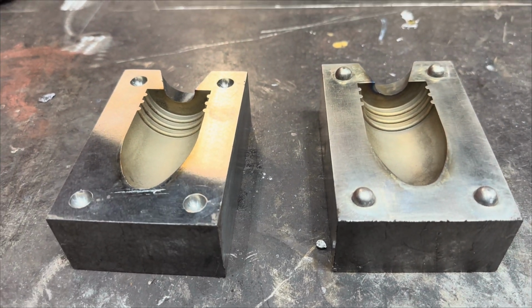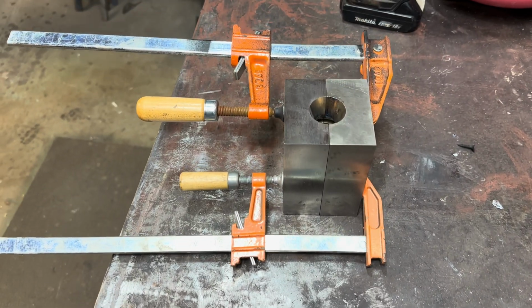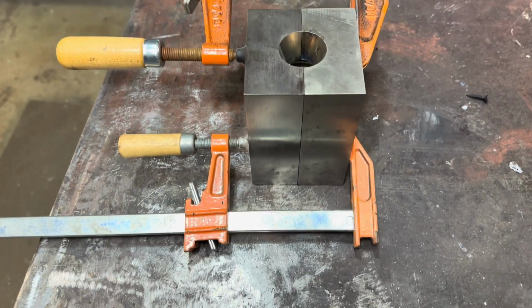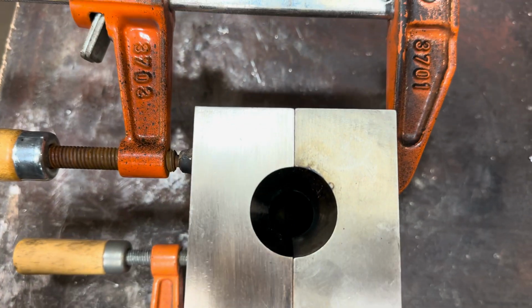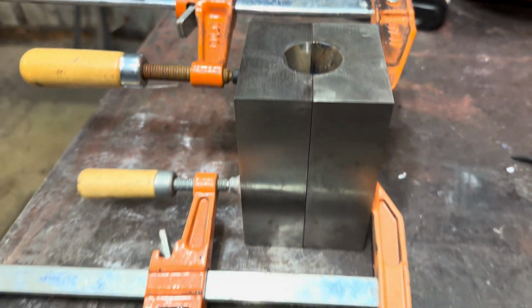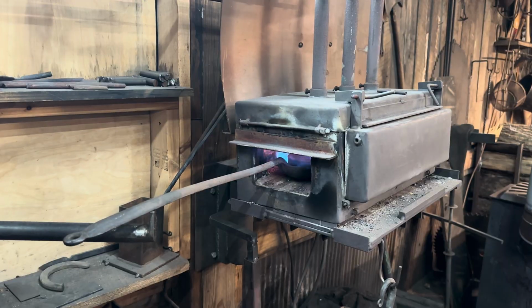So next you guys will see it clamped together, and we put it on the stove top on the eye with a flat eye stove in our shop, and it sits there just long enough where it's not comfortable to touch it. That's going to help the lead go in the mold easier, and it also helps the lead to fill in any grooves that might be inside the mold.